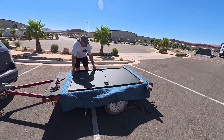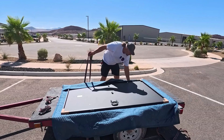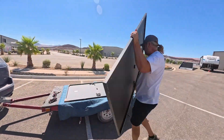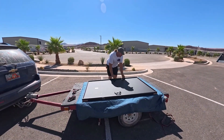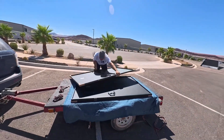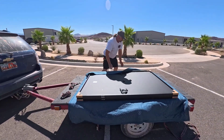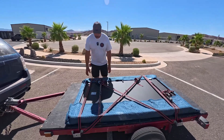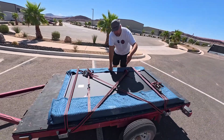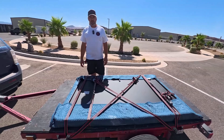This is how I like to transport solar panels — I put them face down on a packing blanket. This is the first time I've hauled multiple panels, so I put a strap underneath the packing blanket as well so I can wrap the panels together in a bundle and strap them all down. Brand new panels come with cardboard on the corners. Line them up square, wrap them, then use a cross-strap pattern and tie down on each end. That way you can go 70 miles of dirt road and not break a panel.